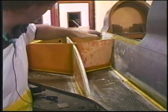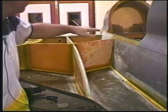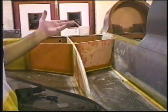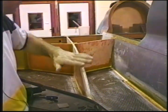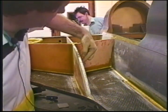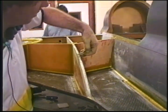A little bit of trimming here, a little bit of trimming on this rib here. And then put the top on, mark the positions of all these ribs on the underside of the strake, put duct tape down where these ribs are, lay up two plies of tape, stack micro on top of all these ribs and squish it down. Let it cure, pop it off, and then lay up two plies of bid, or one ply of bid, I'm sorry, from underneath to the underside of the tape.